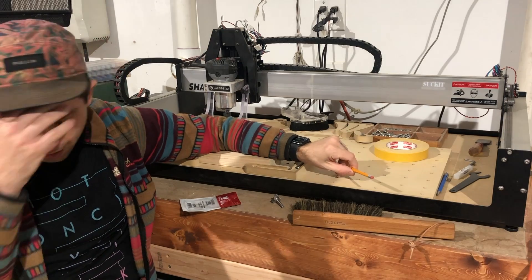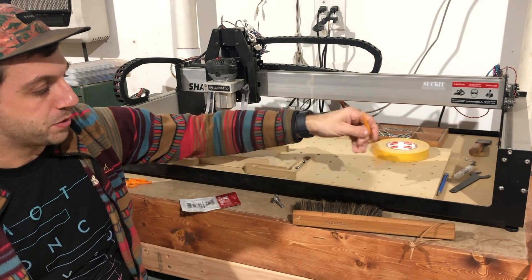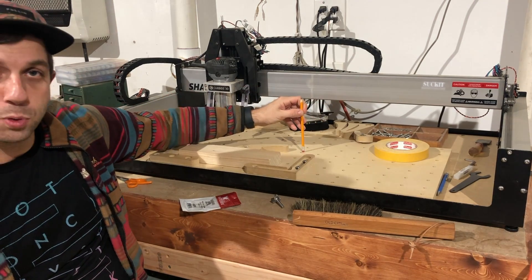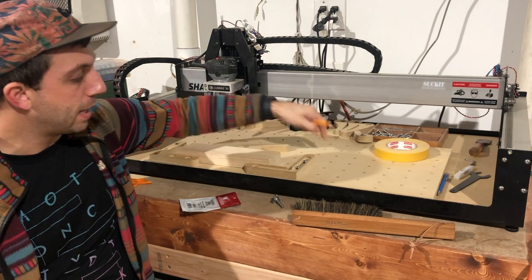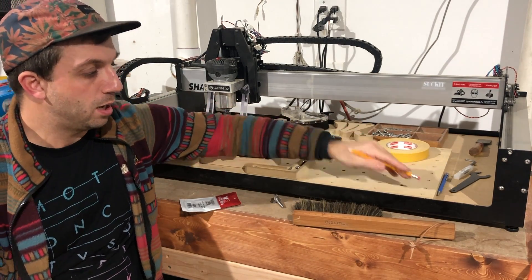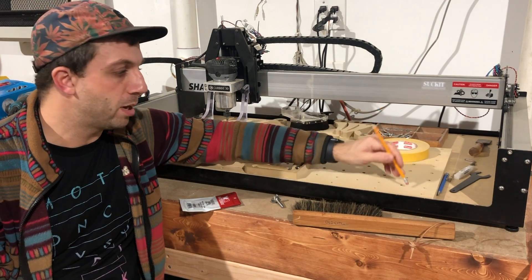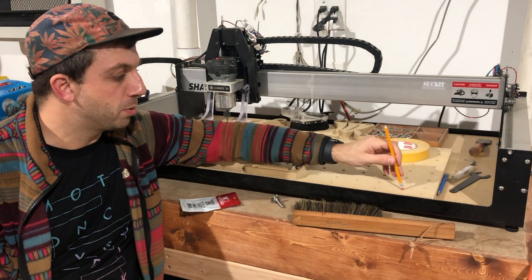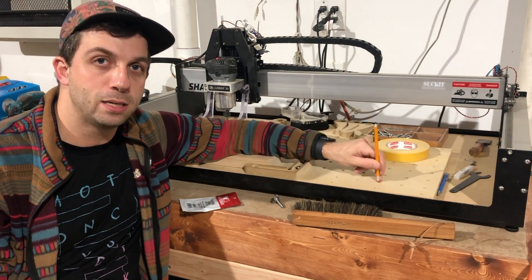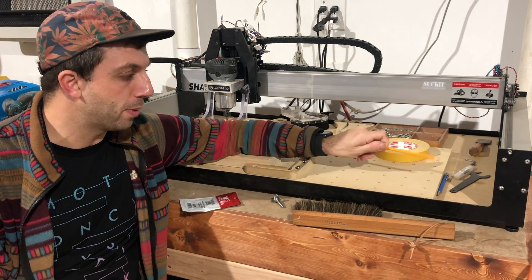One thing I don't see mentioned often: be very careful when surfacing near the front rail — you don't want the cutter hitting it. What I'll do is start the program toward the center of the machine, and as it's cutting out I can feel how high that lip is. If I can tell it's going to cut into the front rail, I stop. At that point you'll want to replace the wasteboard — just unscrew it or pop the nails out and put a new one in its place. Also be mindful of T-nuts: make sure you don't cut down far enough to hit them. Small nails I typically let the cutter cut through since they're lightweight.